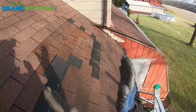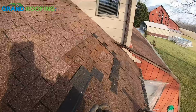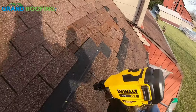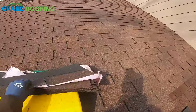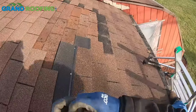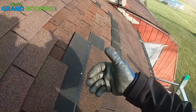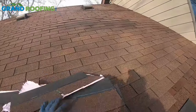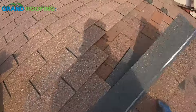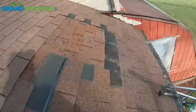You're wanting a specific area, yes, but it's more about the depth of the gauge, the amount that this pushes back, and the amount of pressure you're holding on it versus the back kick, the recoil. If you're blowing through and it's shattering the fiberglass, it looks like there's a hole around your nail, that's too much pressure. If the nail's up, it's obviously underdriven, or the gauge depth is not set correctly. Most of the time it's just your gauge.